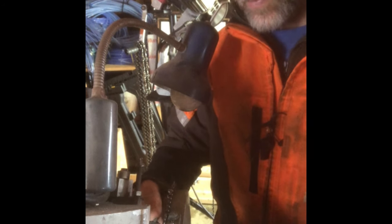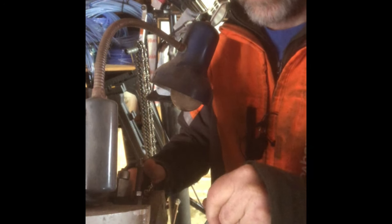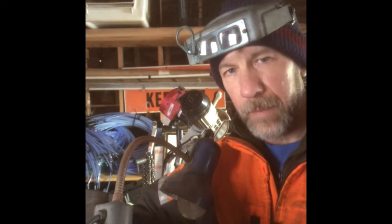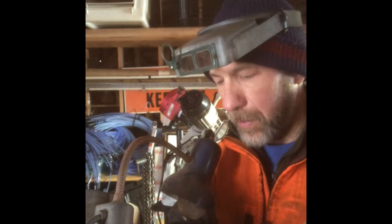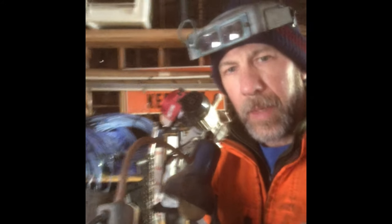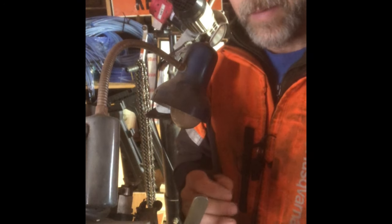Right in here, when I advance the tooth to the stone, there's a spring-loaded thumb that comes down and it clamps that tooth absolutely rock solid — you cannot move it. Then once I get the tooth up to the stone and get to that contact point, I am moving the tooth with two little screws: one moves the tooth forward and back, the other left and right. That's what I'm doing as I'm advancing the tooth to the stone and making contact.